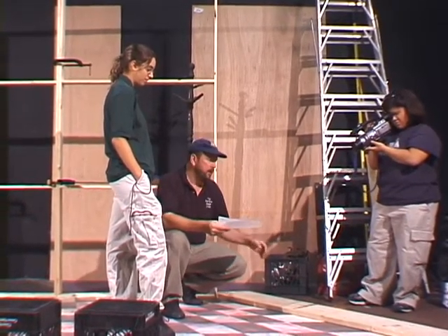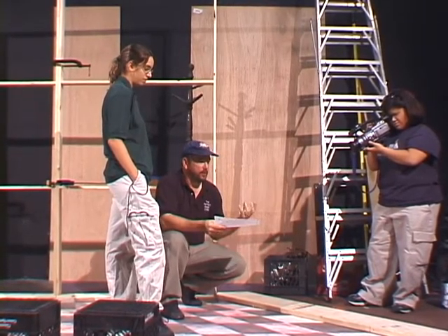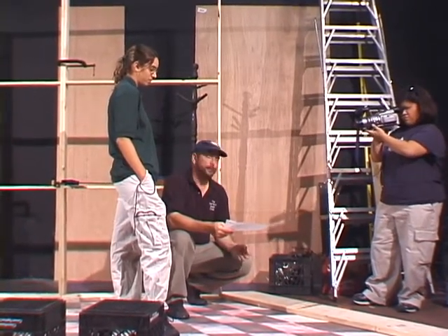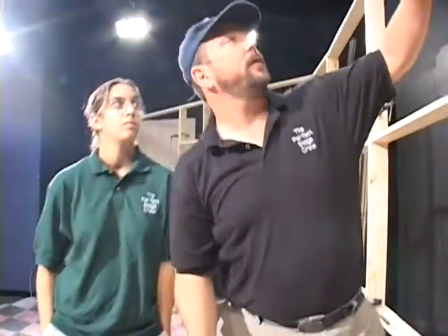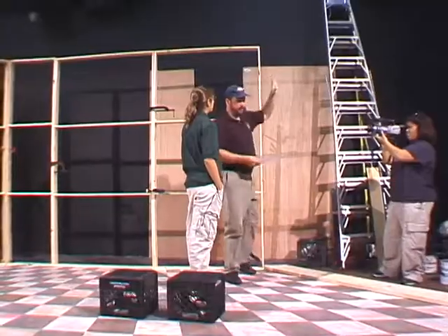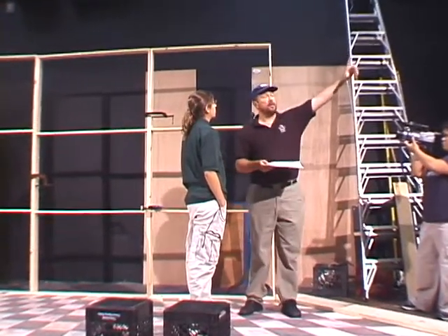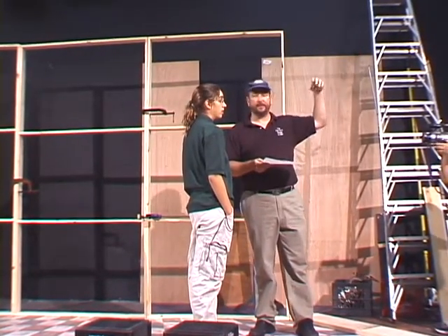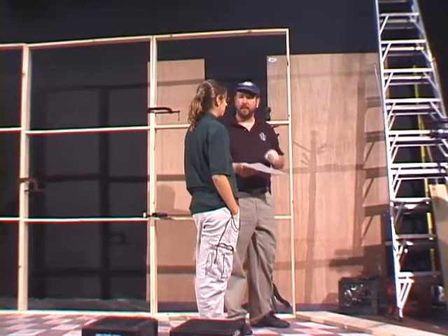Of course, we do nothing but stand there. So we have some 2x10s, 2x6s, and 2x4s, and we're going to screw these things together tight and of course perfectly straight and square. What we need is a vertical member here that goes not all the way up, but up above the door. The doorway itself - all the lumber is here. Across the top is just another flat, which we haven't built yet. We're going to build that last to make sure it comes out the right size. So you and I are going to cut some wood to fit the door that's coming upstairs right now.